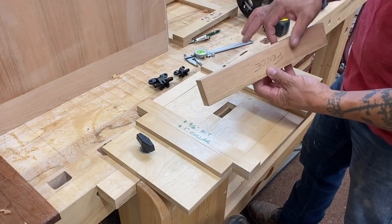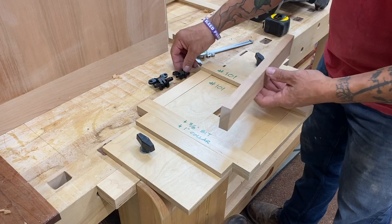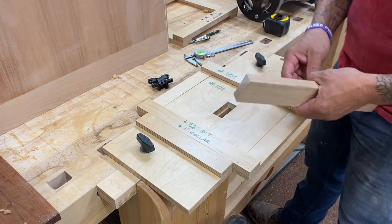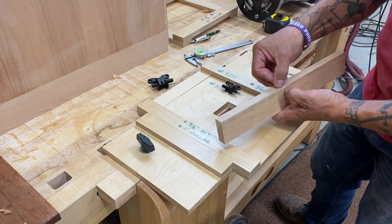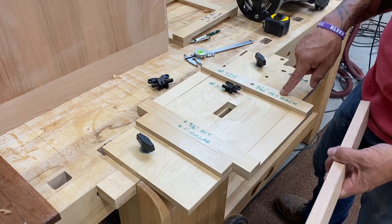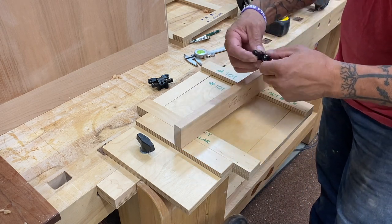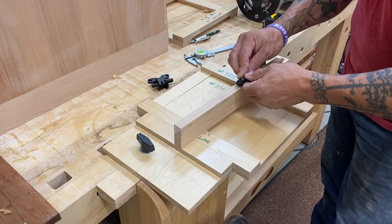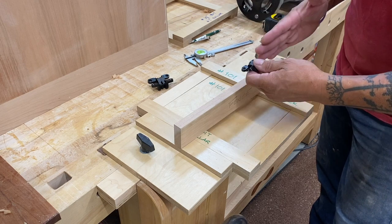I have a scrap that depicts the thickness of the box — the back of the box — and I want to figure out where this hinge goes. I'm using this 101 hinge. From the schematics on the Soss hinge, to get the lid flush with the box in the back, it needs a 3/32nds offset. This is my jig — I've marked a 3/32nds setback, or offset. So what that means is from the edge of this hinge when it's installed to the outside edge of this component, that needs to be 3/32nds. An easy way to figure that out is to go off centers of the hinge.